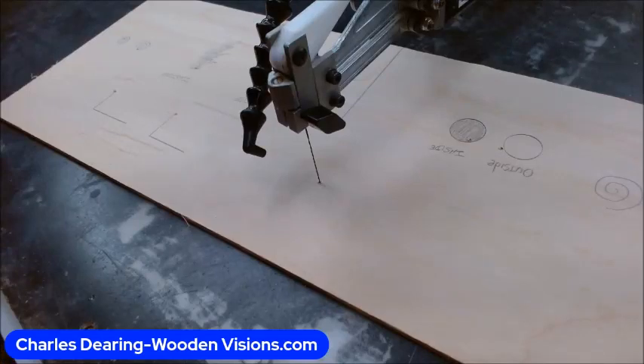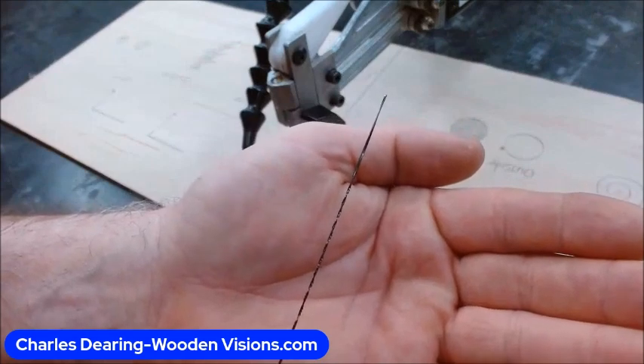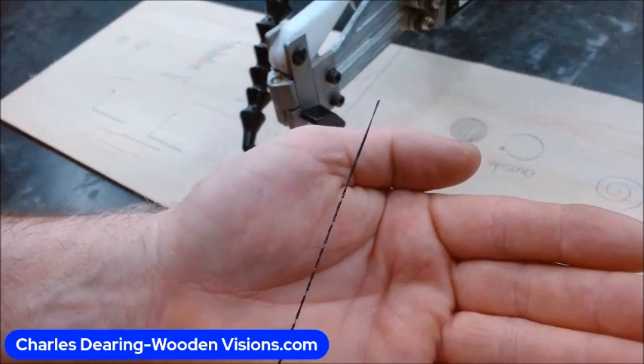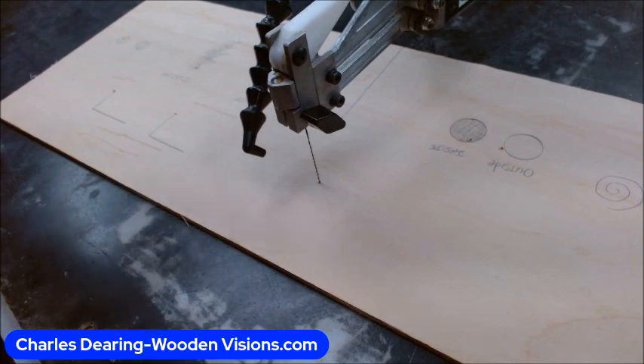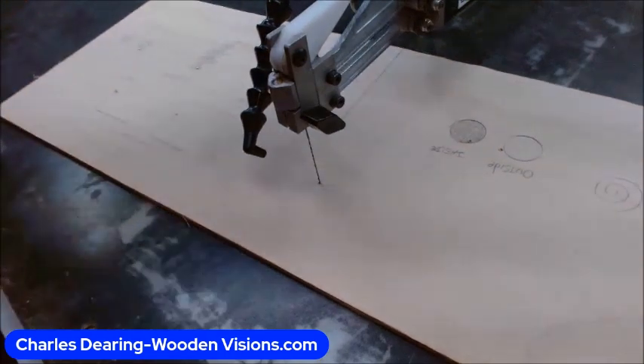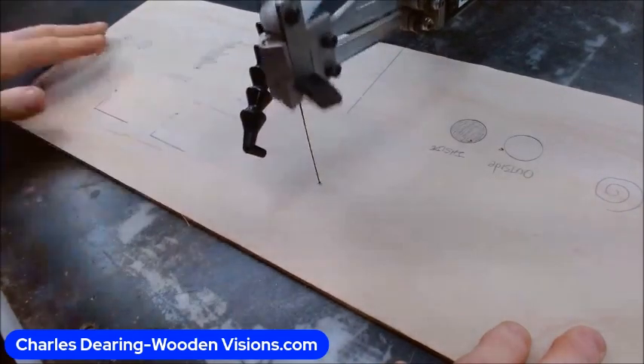Hi, I'm Charles Deering and I wanted to talk to y'all about spiral blades. Some people are scared to death of them and I want to alleviate some of those fears. One of the first things they say is it's so aggressive. Compared to a flat blade — a flat blade has all the teeth on one side so it's naturally going to cut smoother. The spiral blade is just like a flat blade except it is twisted, so it's going to feel more aggressive, but a spiral blade itself is not aggressive, and I will show you why.